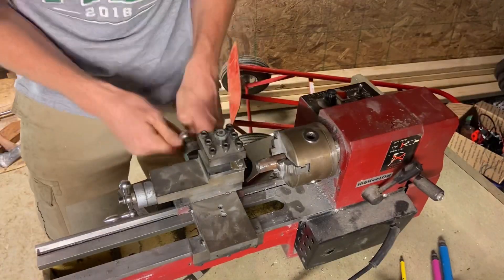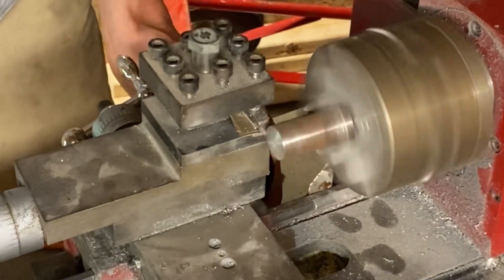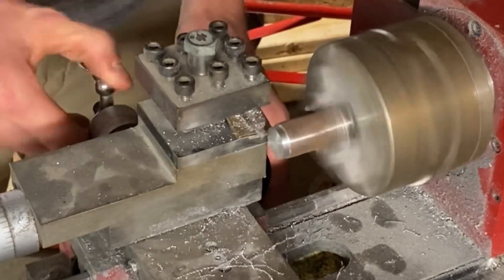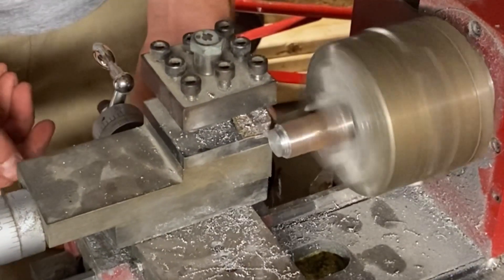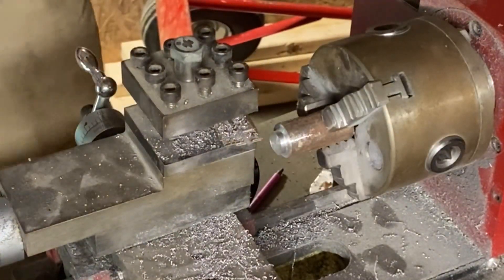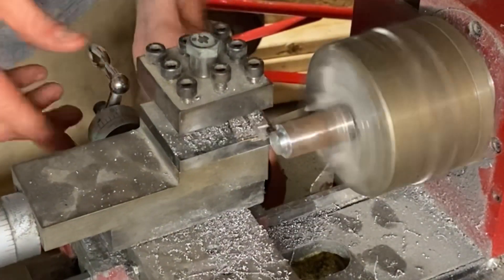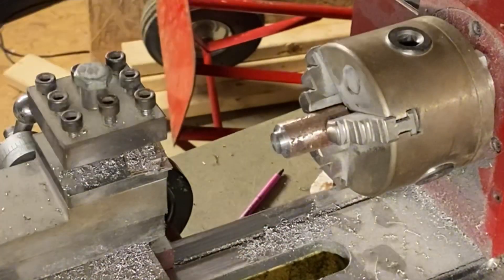The more I played around with this lathe the more surprised I was. It had some arbitrary RPM, a tool that was probably pretty old and dull and cut to a weird shape, and an operator who had no idea what he was doing. And it was still taking 20-thou passes in steel with no real problem. To me the surface finish looked fine — it wasn't anything to write home about maybe, but it was totally fine. There wasn't too much chatter or anything like that. It seemed like it was doing a great job. I was really impressed.